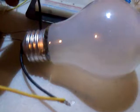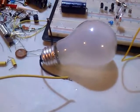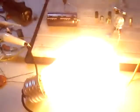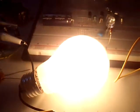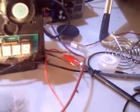So I'm going to go ahead and connect the load. Right now I'm at 6V, and here we go. And at 12V it's quite bright. We are standing at 4.21A. If we make a rough calculation here, 12V times 4A, it's about 40-something watts.